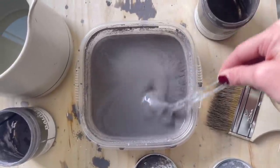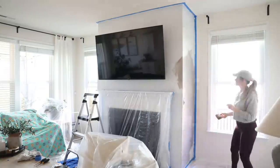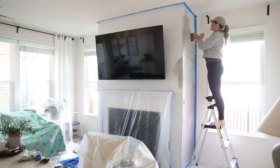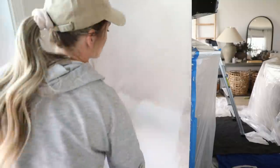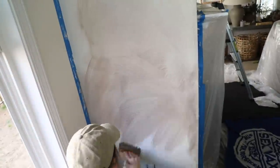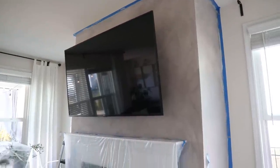The two colors I mixed were Salt Brush and Weeping Sedge. Almost between every dip of the brush I would mix up the paint, because it settles very quickly — by mixing between strokes you get a lot more pigment and texture. For those still wondering what lime wash is: lime wash is a paint made with natural minerals that has almost a chalky effect. It adds a nice subtle texture to a wall and its use dates back to the Roman era, originally made from crushed limestone. The paint I'm using is a thin layer of limestone that dries by taking in carbon dioxide from the air, making it suitable for high humidity environments and even bathrooms.